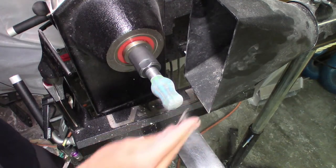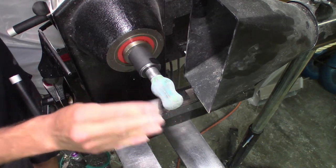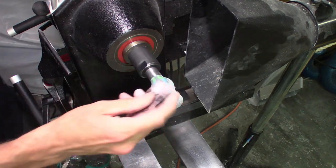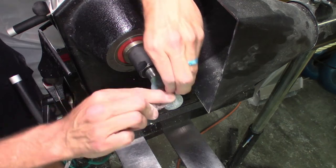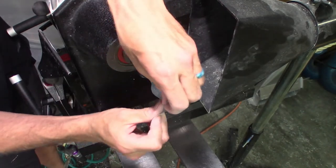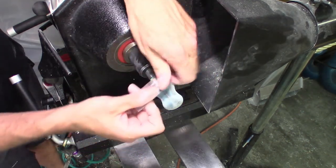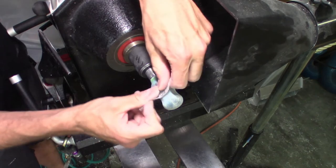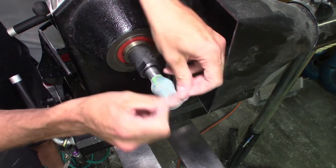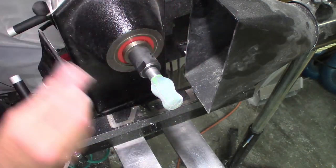It's always good to give it some, I like to call it cross grain sanding. Even though there's no grain, but doing it against the sanding marks that you put in originally, it really helps you to get the best polish. Sometimes you can get away without it, and sometimes when I'm in a hurry or lazy, I'll skip it. But I find it's kind of a crapshoot if I don't do this between grits, basically.